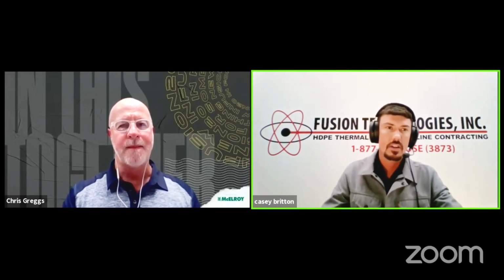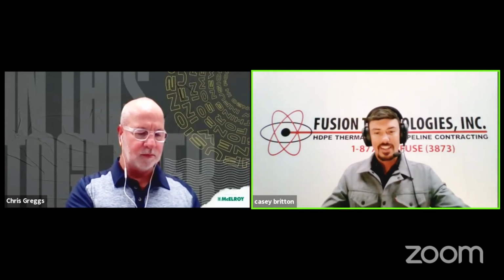Sure. Yes, we do. It's interesting with natural gas distribution was that, decades ago, they embraced HDPE and MDPE, but they do seem much more slow to adopt the latest equipment and more modern methods. But I think the Acrobat is an ideal machine for distribution because those are commonly new tie-ins or services in very narrow workspaces. In fact, they might remove one piece of concrete or put in a service box that a person has to go down in, that will be 4 foot deep and the workspace may be 2 foot by 3 foot. In that situation, this is where the Acrobat would be really useful.